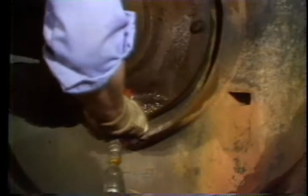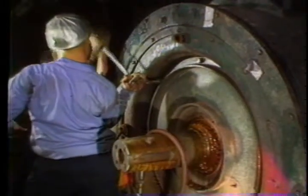To disassemble the brake, first the bearing cap should be removed. On this 6032 there are six bolts that hold it on. If the inside bearing seal is bad and water has entered the bearing area, you'll probably find rust and water. When this happens, the bearings wear quicker and should probably be replaced.